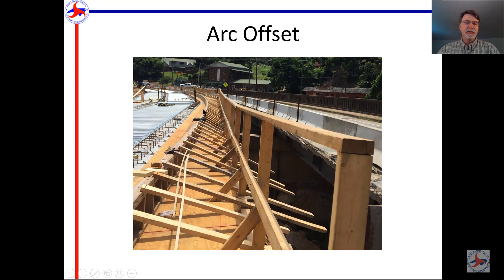Dimension B is the algebraic difference between the bottom of the slab over the center line of the girder and the bottom outside edge of the overhang — it already calculates all of that for you. One of the most common questions on bridges with straight girders and a curved deck is: something looks wrong with my overhangs. You can see the handrail follows the overhang forms showing a big peak, and your initial reaction is that it doesn't look right. What's happening is you have a very short distance at the bent to make that elevation adjustment, which greatly exaggerates the change; in the middle of the span over a longer distance it's not as exaggerated. If you look down the overhang form it has a good shape and is following a proper grade.